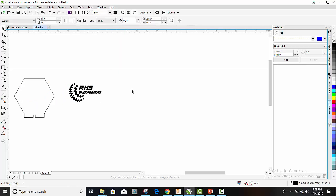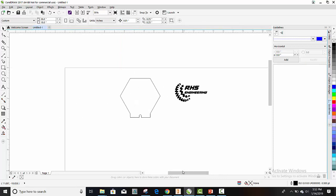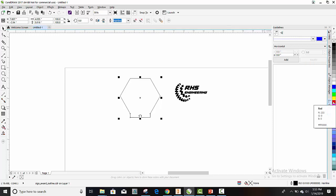There are three things we're interested in when we laser engrave: we can cut, we can etch which is sort of an outline, and we can do a raster which is basically the fill. The first thing I want to do is cut this sign. So we're going to click on this sign and come over here and right-click on red — make sure it says R255, G0, B0. Right-clicking on that is going to tell the laser engraver to cut.